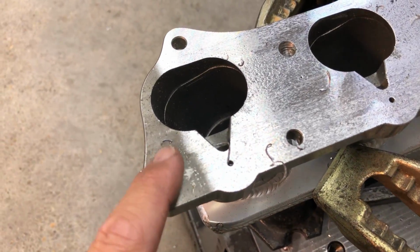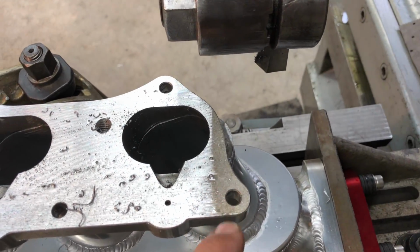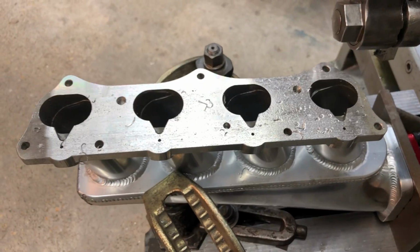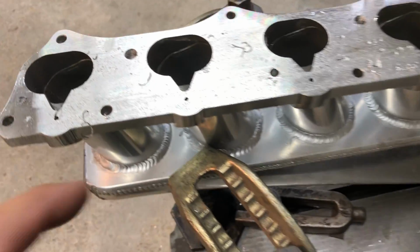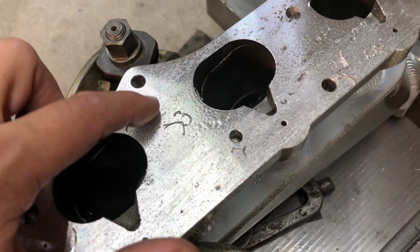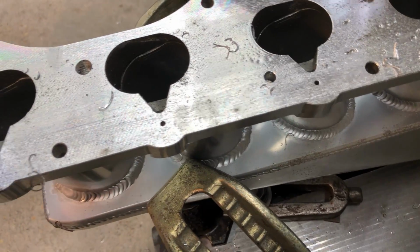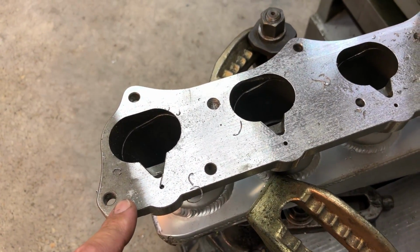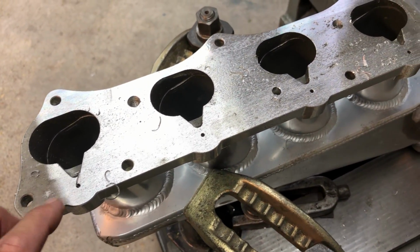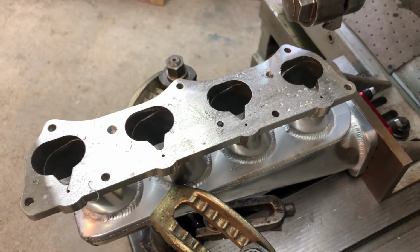See, we were pretty even on our indicating. There's a low there and a low there. It's pretty well even on both sides. It definitely did better with cutting oil over here versus without, a little more etchy. So we really don't have far to go. We'll probably take 5 thousandths now and see what it looks like after a cut.